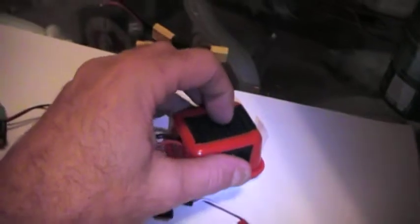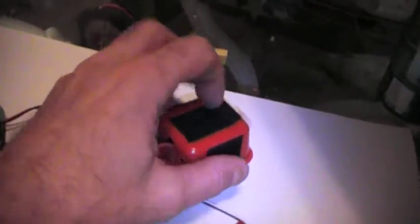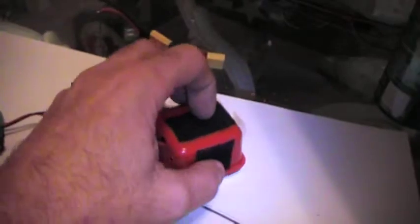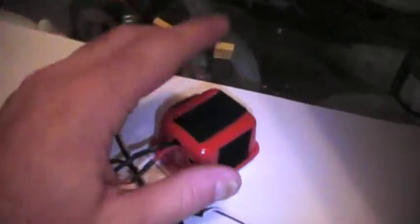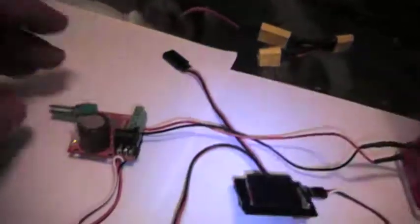This is basically what I've done. Normally all these units would be mounted up around the card with 3M Sticky Tape. He did Velcro for me on this one so that I can remove the units, which is a good idea on all future units. What I did on the other one was replace all the wiring with basically servo leads — take a typical extension with a male and female and cut it in half, or get servo leads.